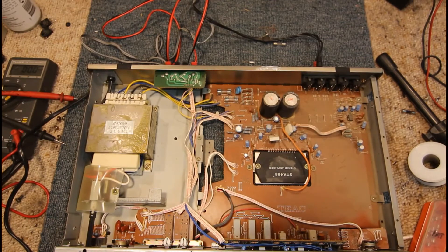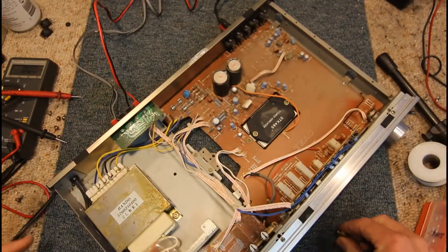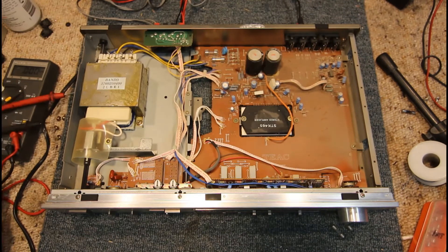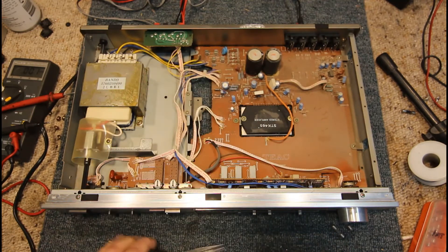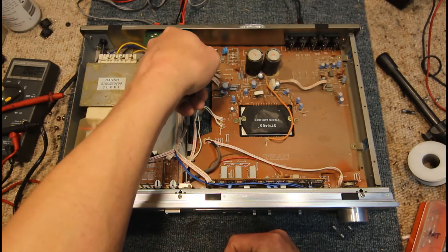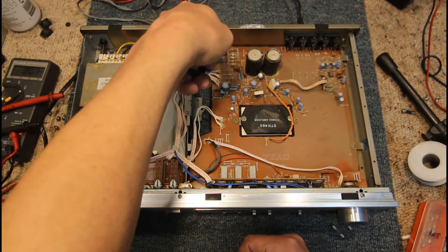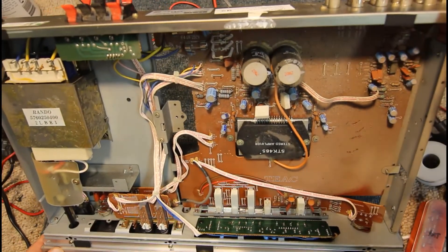So I'll have to find some 4A fuses. If you're not sure if the fuses are going to blow, it doesn't hurt to put something a little bit lower value in, just so if there is a fault still there, it will kill the fuses quickly before it has a chance to do much else. Remove our 3A and put them back in the box. I'm not sure if I've got any 4A quick blows. Unfortunately all I've got is a couple of 5A which we'll have to do for the moment. I'll have to get my hands on a couple of 4A quick blows — hardly anything uses quick blow fuses these days, so it's not something I've really got in stock. F4A 250V.